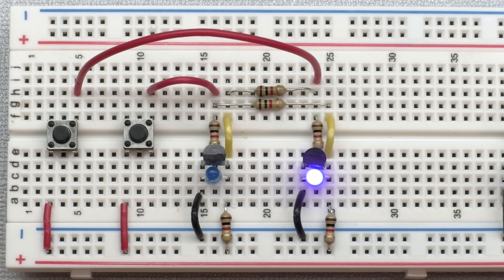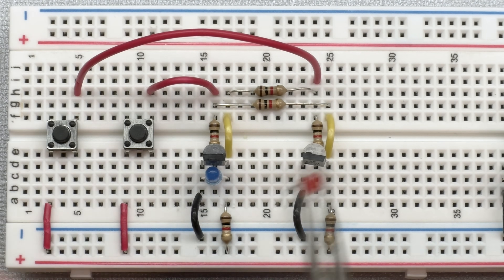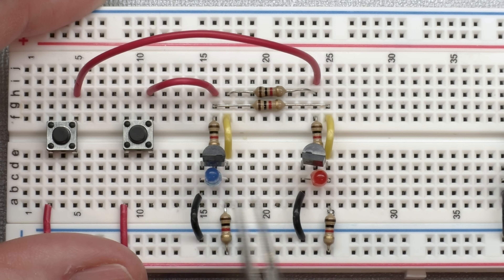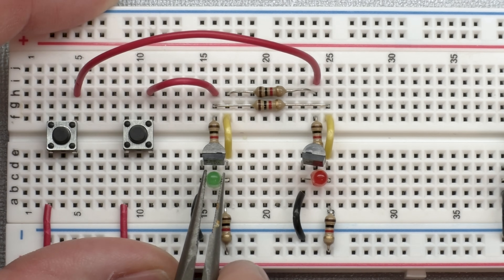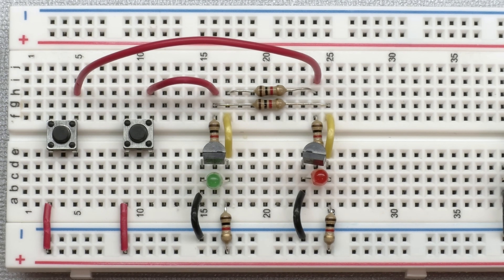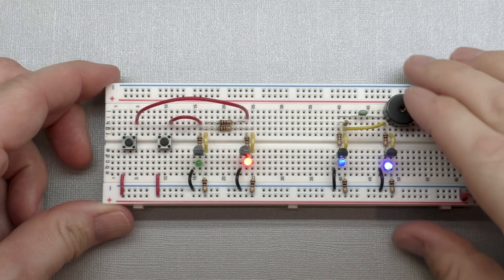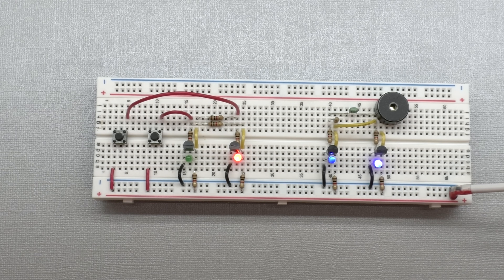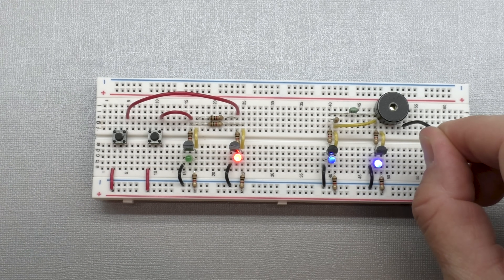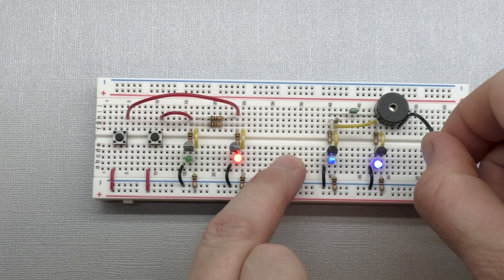It's a little confusing because both lights are blue, so we want to create an on/off switch. We'll disconnect power, swap one LED for a red light to simulate the off position, and swap the other for a green one. Now we have an easy way to visualize on and off. Zooming out, you can see we've completed two independent circuits: the SR latch we just created and the oscillator we completed in the step before. We can't hear the oscillator currently because I disconnected the ground wire.